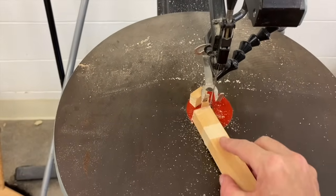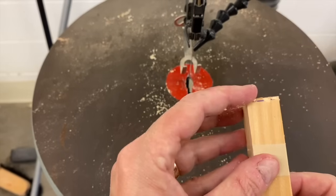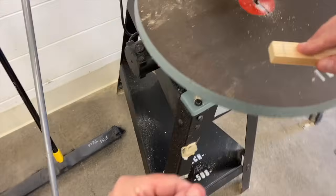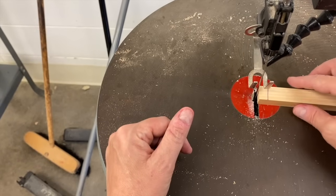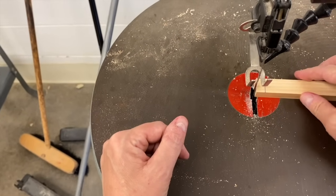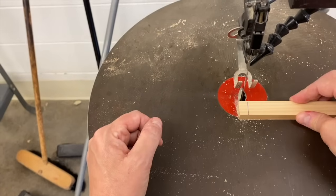These little pieces near the blade — I don't want to reach in, but I can use my piece of wood to knock them out of the way. The best case scenario is to have your presser foot just slightly above the piece of wood, because that stops the bouncing. Even though you're pressing firmly on the table, this is one more tool to help prevent bouncing. But you can't always find a scroll saw that allows that — sometimes the presser foot is set up taller. This will still work; we just have to be extra careful holding our wood down.